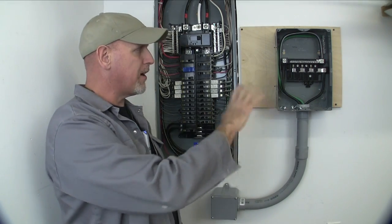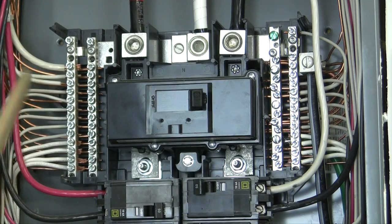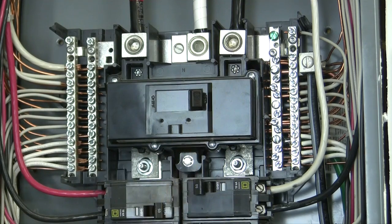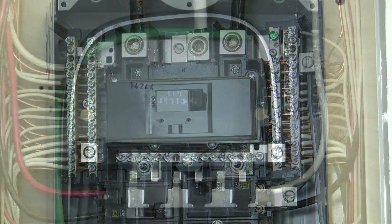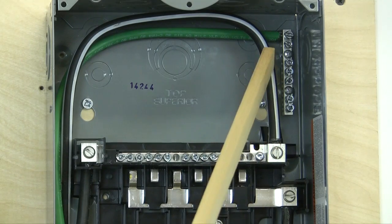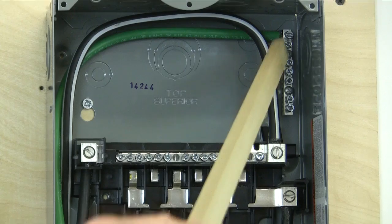So that's what I use for the wire — let me show you how all this stuff hooks up. I've actually got everything put together and hooked up — all my conduits run, wire pulled, everything hooked up. Before I show you, I want to point out a couple of things in my main panel. When I wired this house I was real neat and meticulous — you can see all my neutral wires going to the neutral bars and behind that my ground wires going to the ground bars. Those neutral bars and ground bars are essentially connected by virtue of that green screw right there, which is bonding everything together. Now contrast that with the sub-panel. For my application on this sub-panel, the neutrals and grounds are isolated from one another. Usually when you buy a sub-panel it doesn't come with the little grounding bar — you just buy it separate.